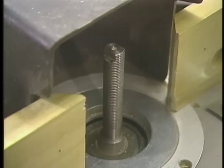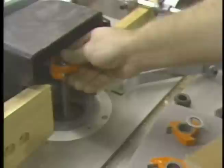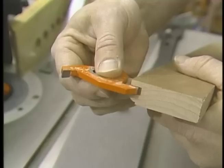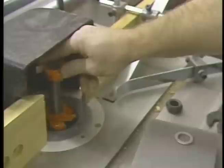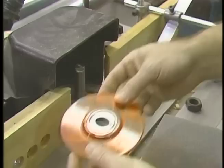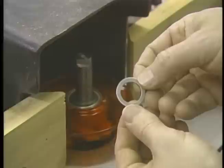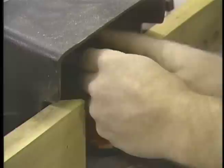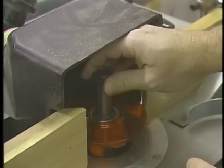There's a variety of cutters you can get. To make our doors, the first cutter we're going to put on cuts the little cove — it just slips on the shaft. All these cutters I'm using today are carbide tipped. The second cutter cuts the groove, and the third cutter just cleans the edge along that back side. All these cutters fit nice and snug on the spindle — it's a very precise tool. Now a washer, and then this little device, which is a safety guard made out of Lexan — it slips down over the cutter to keep your fingers away from it. Another washer, and then a very important washer which has a little pin on it that slips down onto the shaft into a groove, keeping the nut from loosening up. And then, of course, the nut. We'll tighten this all down and be ready to run some pieces through.